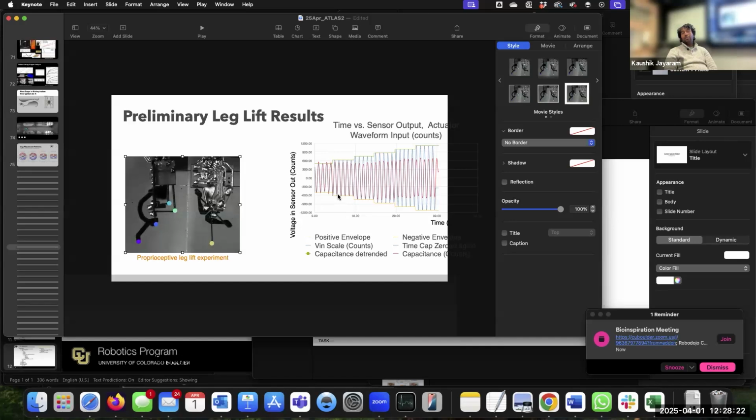At some point, I think we're going to again be limited by the communication speed between your host and your system. Wi-Fi is already a bit costly for this robot. To run around, these robots consume about 25 to 100 milliwatts of power. I think Bluetooth would be great, but there are small spaces, and there might be restrictions in terms of other things. So doing this kind of swarm or collective thing, or communicating with a central hub, is definitely one of the directions we can leverage, and that's what we're trying to do.